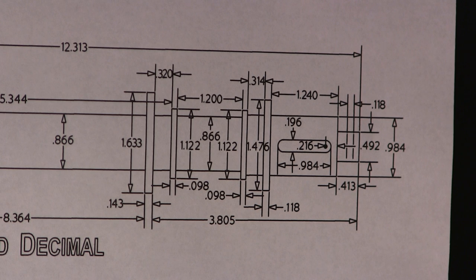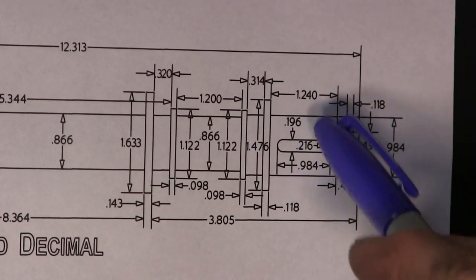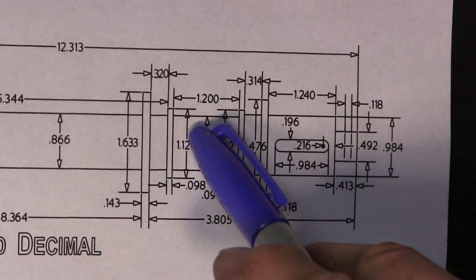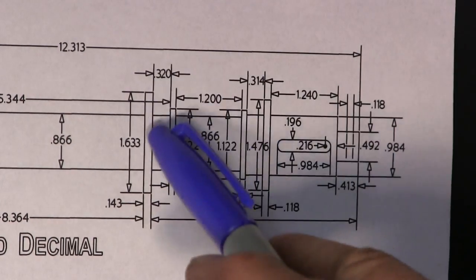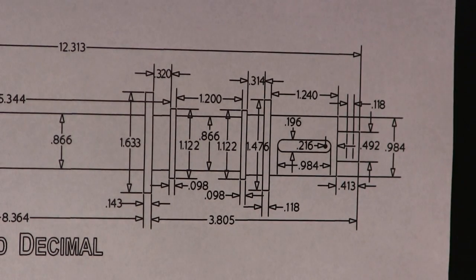We'll have a little bit of freedom to do that by plunging in our grooves where we need to on each side of those flanged or raised areas. You have the wheel fits on here. This is a bearing surface, and then this is basically the clearance in between the sprocket and the inside of the bearing retainer on that side.